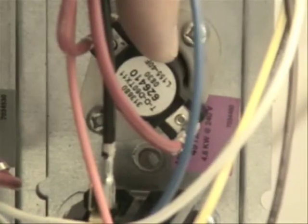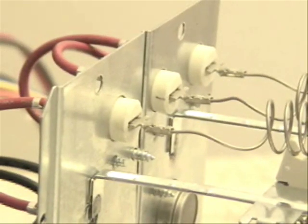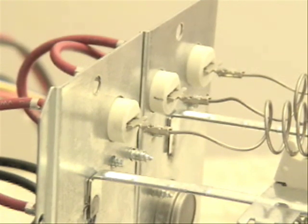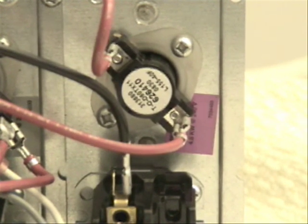What we have here is a limit switch. Its job is to make sure the heat from the heat strips doesn't get too warm — it cuts in and out according to the temperature inside the cabinet. For example, if your blower motor were to fail, it would keep your heat strips from energizing. One thing I found really strange about this particular heat kit is the fact that it doesn't have fusible links, which would normally be here, or here, or down here. This heat kit depends upon this limit switch alone, which may be a little too much for my liking.